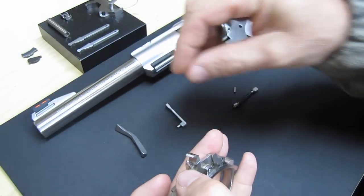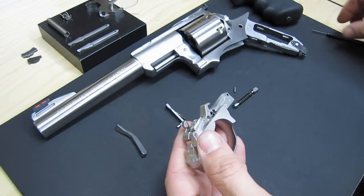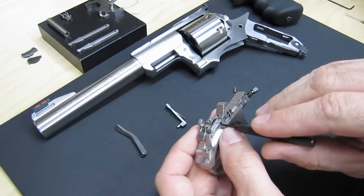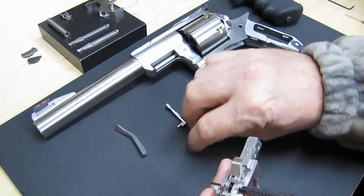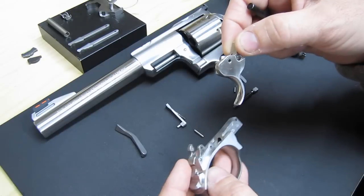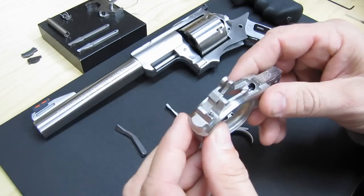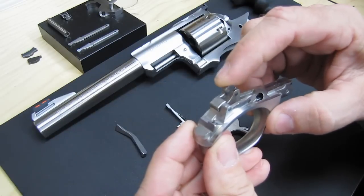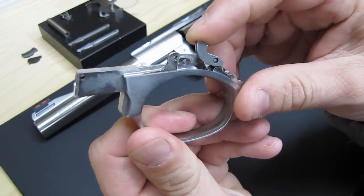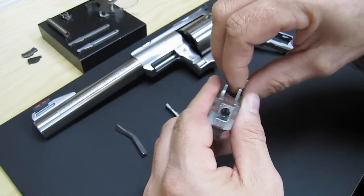It almost took off. You can take it off now or you can take it off later — it just depends on how you want to do it. Then once you do that, you can take your punch and push out the pin right there. Your trigger will come right out like so. Now the only thing left on the trigger guard is the cylinder latch, and that also has a little plunger right there on that side. When you take that off, you slide it off and just kind of try to block it with your fingers and try to catch it.